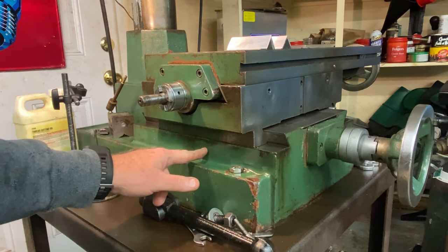I taped a small flat washer on the back of this to give me some spacing, and that worked out pretty well — we'll set that aside for the next one. This is the M5 hardware that comes with it. By the way, the drill I was using is a number 19 drill, which is 166 thou — 4.2mm is the tap drill for an M5, which converts to 165 thou. Close enough. These lock washers and flats don't come with the kit; I'm putting stainless ones on because the ones included are kind of crappy. There's your front bracket — haven't even tightened that yet.